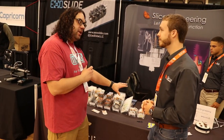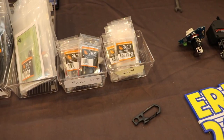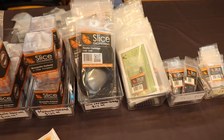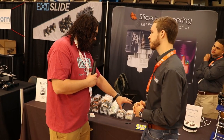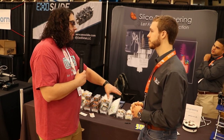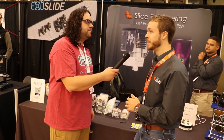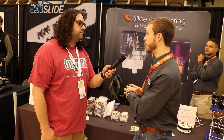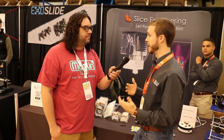It looks like we've got some parts here — nozzles and fans. So if something goes wrong with your Mosquito, it looks like you can buy parts to fix it without buying the whole thing again. Yeah, absolutely. The concept behind what we're doing is sort of like a Lego block concept — if something breaks, you can swap in the next part, and everything in our system is pretty modular. Even the difference between our high-flow Magnum and the standard Mosquito: you literally just have to swap the heat break and get an insulator, and you can upgrade from your standard Mosquito to the Magnum if you wanted to start printing higher flow rates.